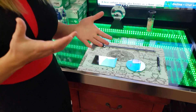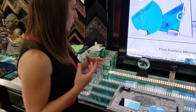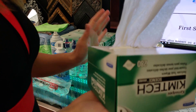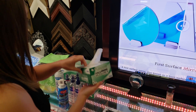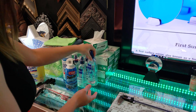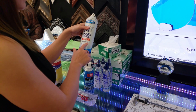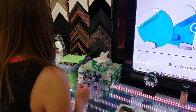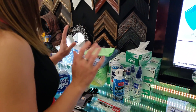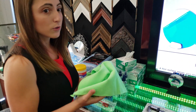For optical mirrors that have more than just dust and have a first-surface coating, you want to use Kim wipes. It's a nice soft surface that won't damage the coating. For a cleaner, we recommend the Zeiss isopropyl alcohol or a foaming action glass cleaner. Just make sure it's ammonia-free, otherwise it will degrade the mirror coating over time. Here's a great example of what not to use: an abrasive Lysol wipe. Oh my god, I can't even. Now I'm going to demonstrate using a microfiber cloth, which is great for our classic glass first-surface one-wave mirror.